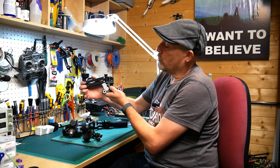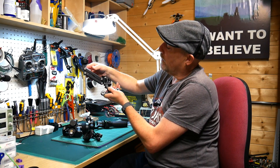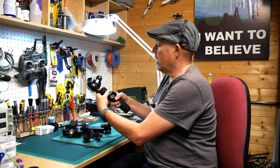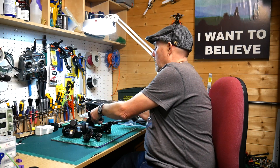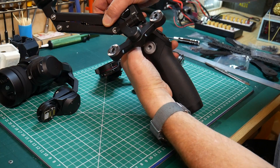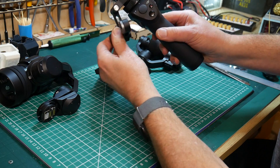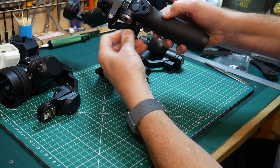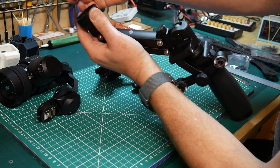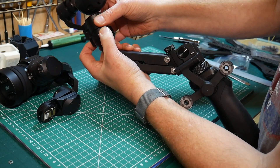It's basically a simple steady cam mechanism which uses a spring between two opposite points on this parallelogram to eliminate the bounce. Fitting it is pretty easy. You just unlock the X3 camera, fit the 4th axis, clamp it up with the restraining screw onto the rosette, and then fix the camera onto the top of the 4th axis adapter.